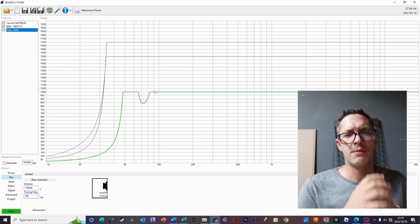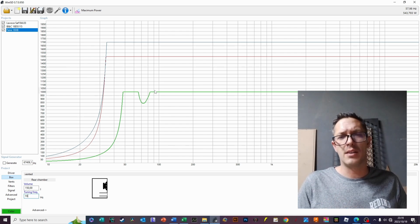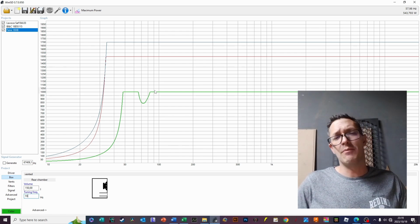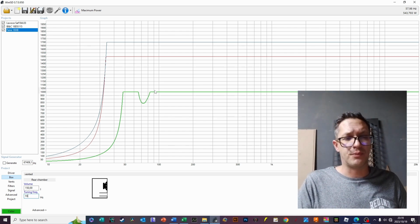Gentlemen, if I can give you a solid piece of advice, when you are designing your enclosure, it's very important to understand that these speakers with these astronomical levels of high cone displacement are terrible to work with, because one, they often produce more distortion the further out they go, and that is completely undesirable. However, if going for low frequency is really the task at hand, then you need a driver with lots of cone displacement. Just because you have more cone displacement doesn't necessarily mean you are louder. It's just better suited to produce longer wavelengths, because that speaker has to move a given amount at a certain level of power input.